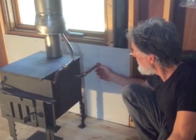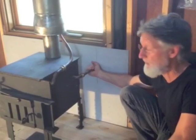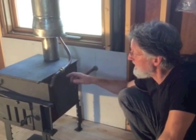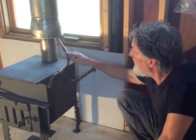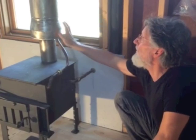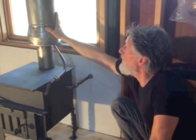This is grade-A copper. This is the cold water coming from the bottom of my water tank, which I'll show you in a moment. It goes in here, the fire hits it very strongly, and then the heat rises and exits out here. The piping takes a turn and goes up alongside the flue, which I have packed with rock wool to keep both the pipe and the flue very, very warm.